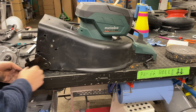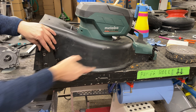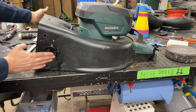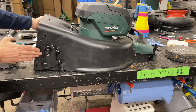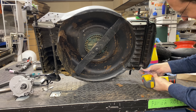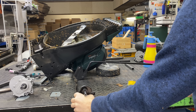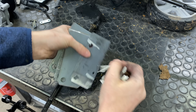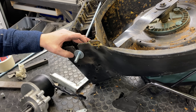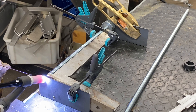I found a problem: this distance does not stay constant because this arm is longer than this arm. So I need to rebuild these and they're also sticking out quite far so I'm going to make them a bit shorter. The linkage was held on with some retaining bolts and then I could take the whole thing off and use it as inspiration for the new linkage. The new one will be very similar, just the dimensions will be a little bit different. I'm using this flat bar for the sides and I drill them all at the same time to make sure the distances between the pivot points are exactly the same.